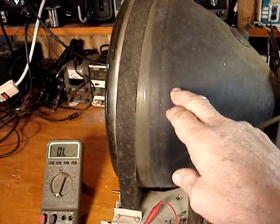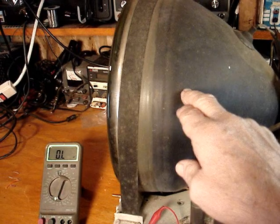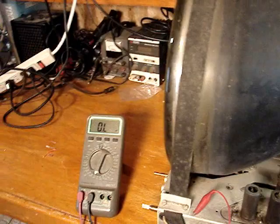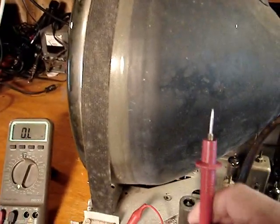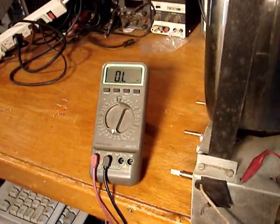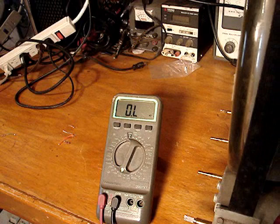The capacitance of this inner coating and outer coating to ground on the chassis filters that out. So I think that could be one problem. I've got a ground connection on my ohmmeter connected to the chassis, and if I touch my probe here, I get nothing. I get closer to the source — nothing.